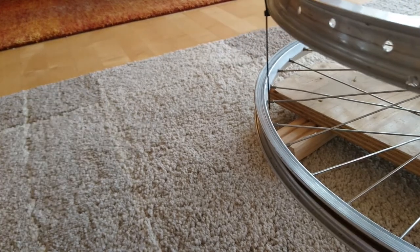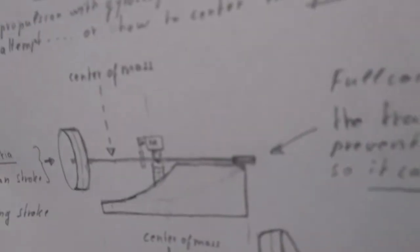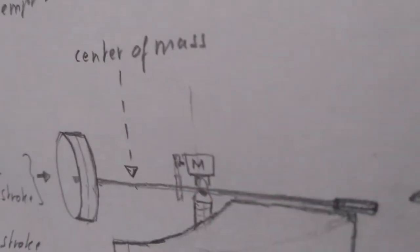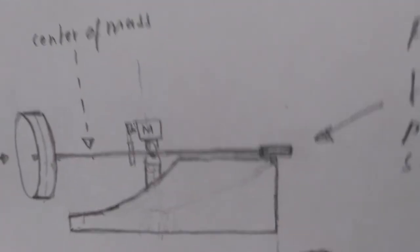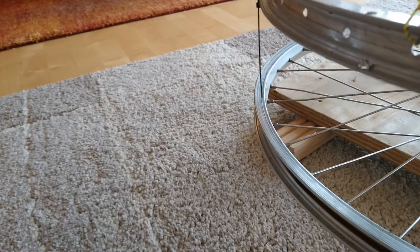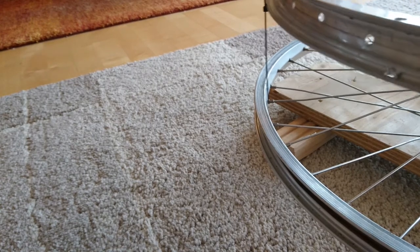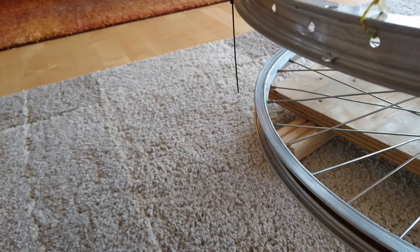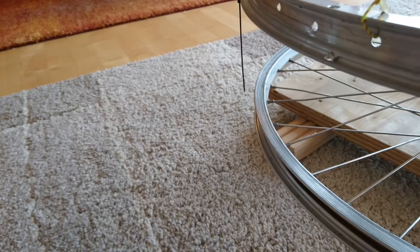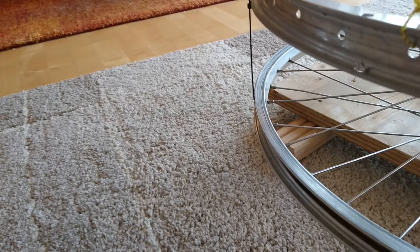Okay, and you understand very well now that on this motorizing side, if it wobbles too much, the traction wheel is no more flat and it can wobble also and let the gyro make some small precession. This is why these pendulum systems are really bad for this kind of system. Okay, now it seems to be somewhat more stabilized. Well, it's very difficult to say. It seems that it is just a bit more outside. Yes, it could be more outside than inside.